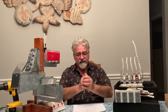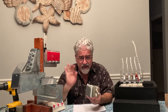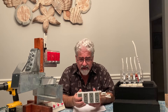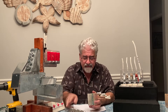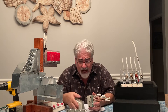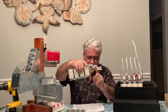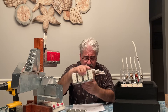Part of this product is the hub. The hub is not just for receptacles at certain heights — you could use it anywhere, and more importantly you could use it for different devices. This is a number 14, 15-amp receptacle, so if you're going to use a number 14 wire, that's what you would use. Another wire used commonly in the home is the number 12 wire — this is the number 12, 20-amp. But as you can see, there are only number 14 wires here, so when I plug a 20-amp into the hub, there's no electricity — that's a safety feature.